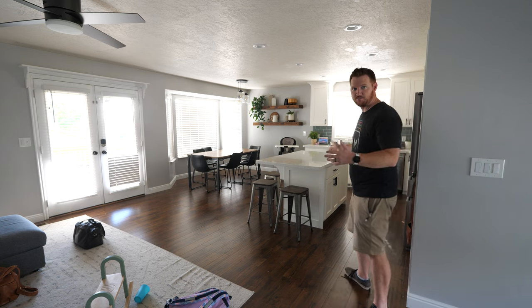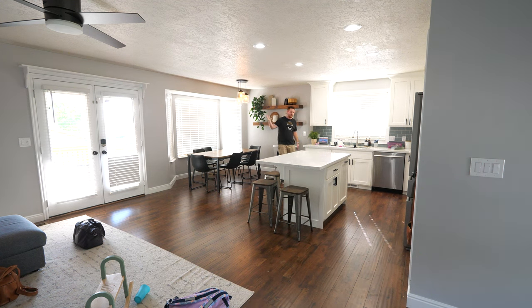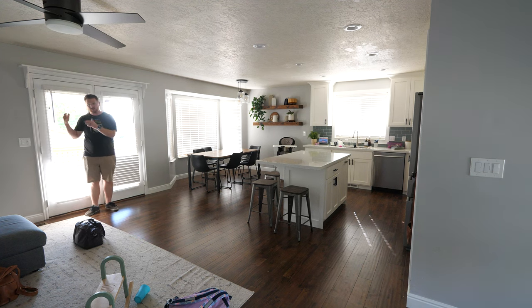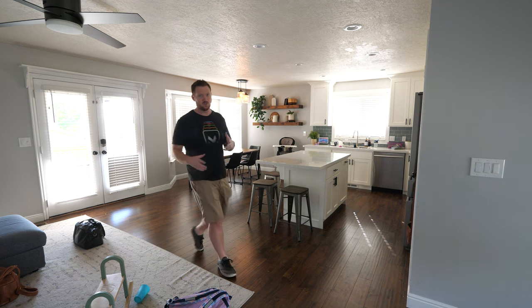Let's turn off the can lights. Going to the kitchen Pico remote — when I turn on the lights it turns on both the can lights and the table light. And since this is a dimmer, if I try to dim it's only dimming the can lights because the smart switch doesn't have dimming capabilities. Let's turn those off and you'll see both of them turn off. And lastly, here's the deck light — I can turn on the deck lights, but now when I push this button it also turns on the kitchen lights. That's one really cool thing you can do with a Pico remote.